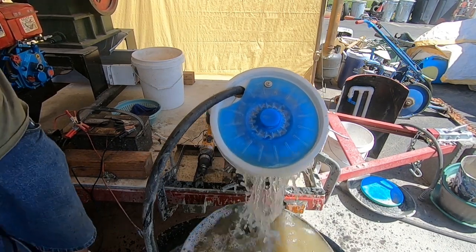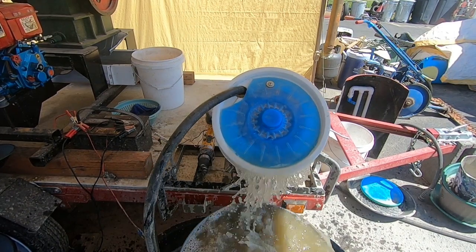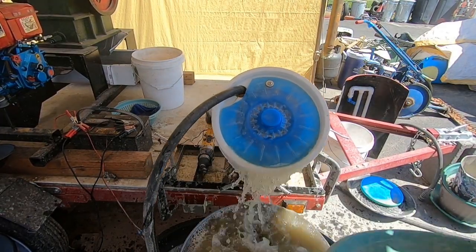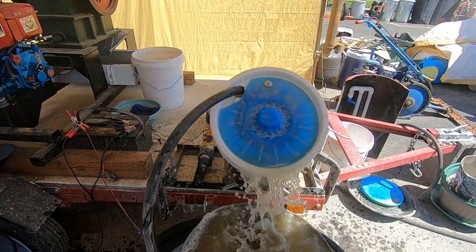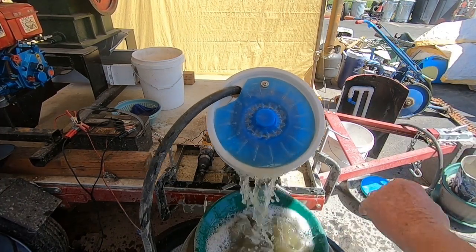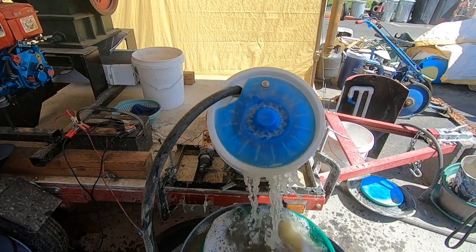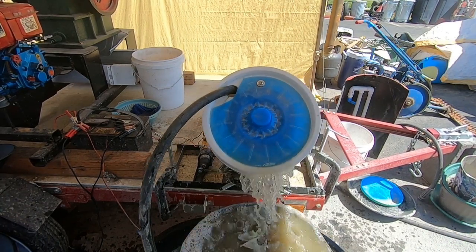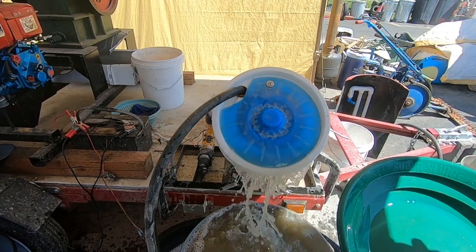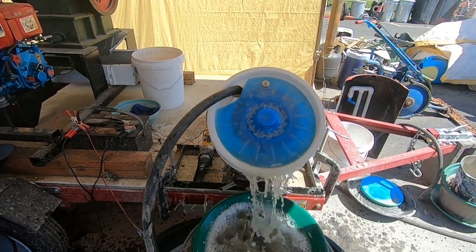This thing here is doing a fine job. Over the last few weeks as I was playing with it, this is about my third iteration on what I wanted. I wanted a five-gallon bucket unit that I could do it with — so when it wears out, I just flip in a new bucket. What I've done is collected material coming out of this, and after collecting it for a significant amount of time, I would pan it to see if there's any gold coming out. I don't want any gold to come out, and basically nothing is falling out — just the lightest, fluffiest material.